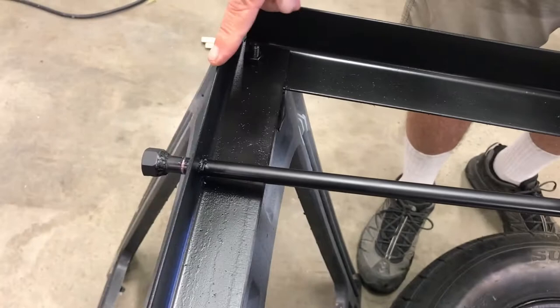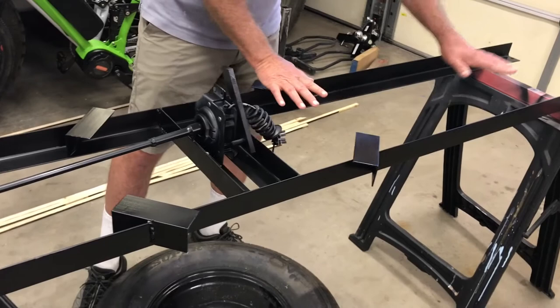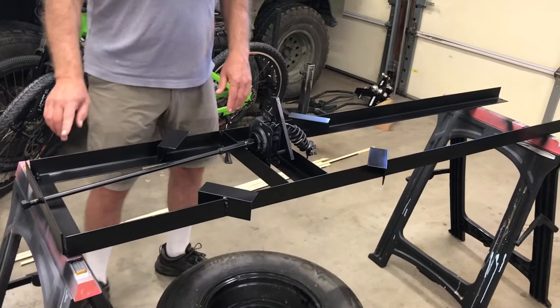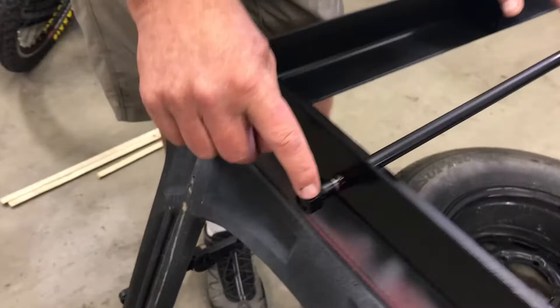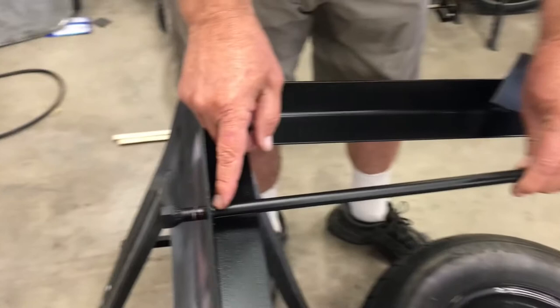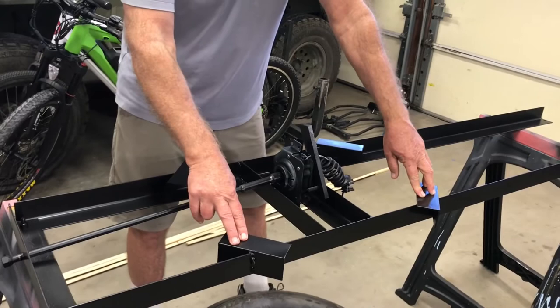This is how you winch it from the side — it's about 24 inches to the center. I did this because this is for one spare tire, but in the future I may put two, so I could add a whole other apparatus on the other end. I welded on a three-quarter nut so you can use the same tool as your jack stabilizing jacks, and I put a little cotter pin to keep the whole thing in place so it can rotate.